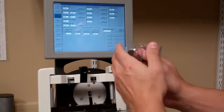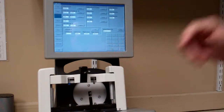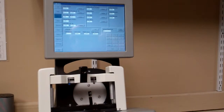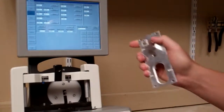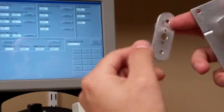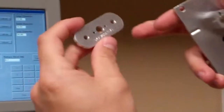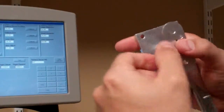Once done with lens size, remove the lens. The next item is Axis Offset for pattern/lens tracing — this calibrates the axis for drill mount or semi-rimless lenses. Remove the lens holder piece and replace it with the oval-shaped metal piece with a flat side from your kit. Line up the holes and attach it using the magnet clip.